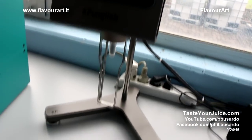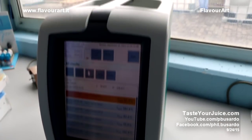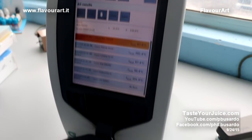This machine here measures the viscosity of liquids, and this machine measures the flash point of liquids — that's anything: the base, the flavoring, the final product. The flash point is basically the temperature at which, when you touch it with fire, it bursts into flame. This is very important for transportation. And this is actually something very important because some of our larger customers in the States that are GMP ISO are asking us for these measurements, and we are delivering them.